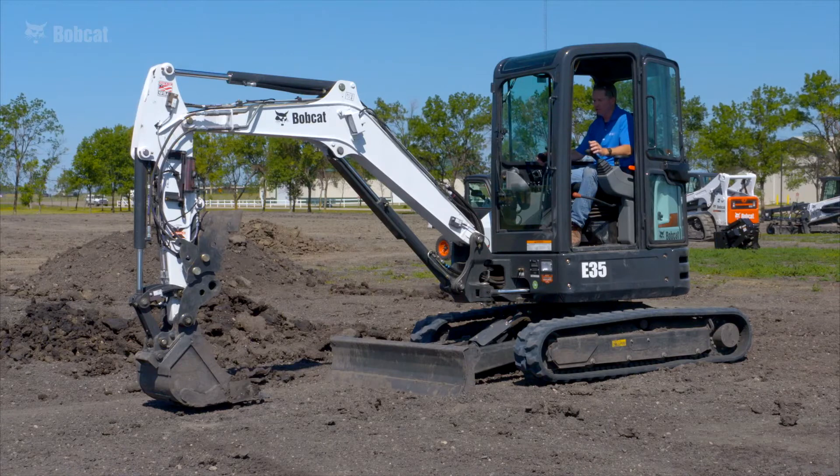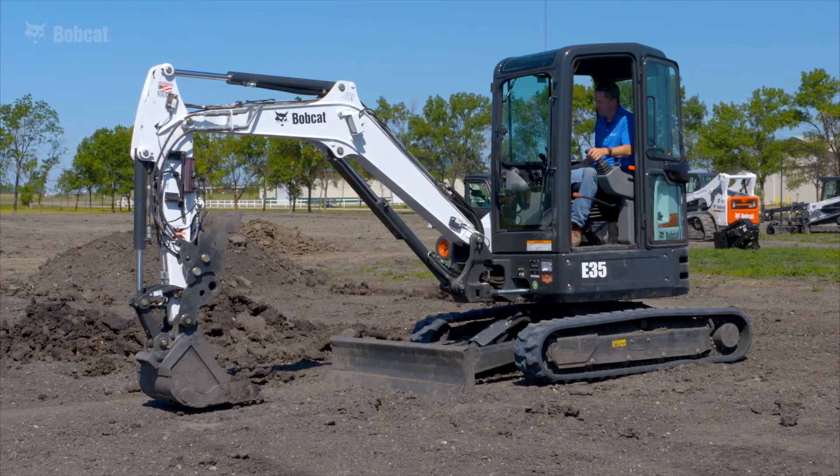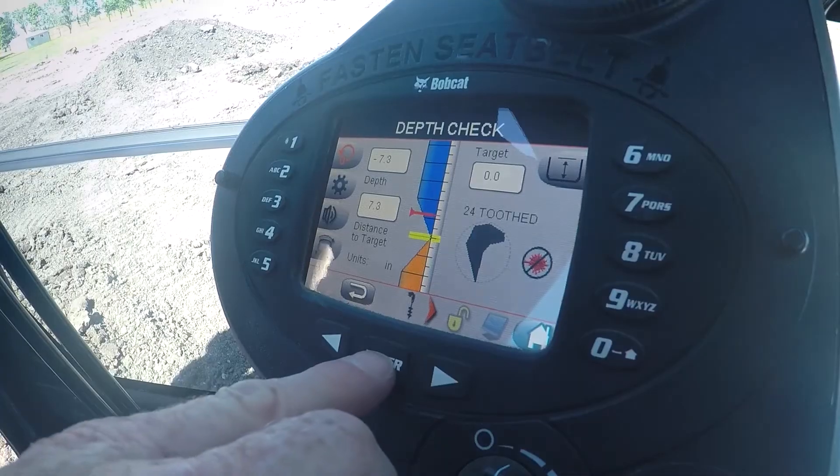Just a little quick background on the job. Imagine this is a building site where I'm reading the drawings, and the drawings tell me I need footings scattered throughout the plot that are at 16 inches below base grade. We've been told where base grade is, and we've set up our beacon at 60 inches above base grade. I'm going to go into the machine and turn the laser on.